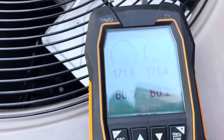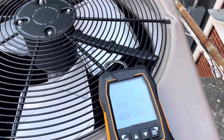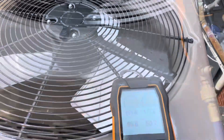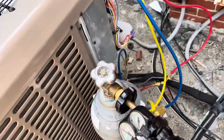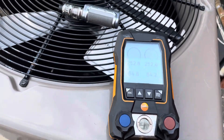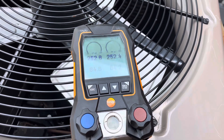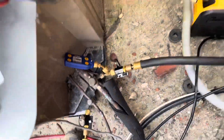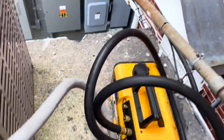All right, I brought her up to about 171 just to see if I'm getting a holler from Kenny up there soaping up the fittings. I haven't got a holler so far, so these don't seem to be moving much. I'll probably bring her up to 250 or so now. She certainly is eating some nitro though. We've almost cracked 250. The number is 252.8, 252.4. We'll give her a few minutes. All right guys, we just put her on vacuum — Schrader cores removed, large hoses, micron gauge on the T they had there, and we have our gas ballast open until we get below 1,500 microns or so.